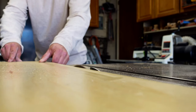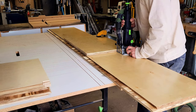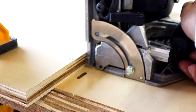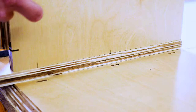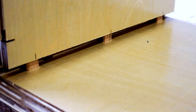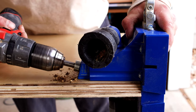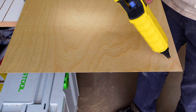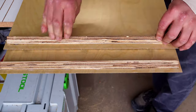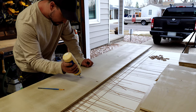After cutting the middle shelf and its two support sides, I domino them in place to the bottom panel, and I'm using pocket holes on one portion. It's usually a good idea to hot-glue on clamping cauls so that you can clamp the miters together quite well, as you'll see in this video. But in this case, it turned out to be a bad idea.